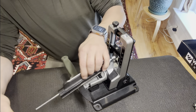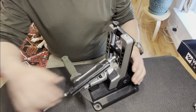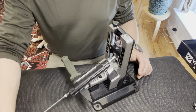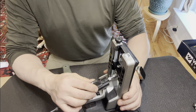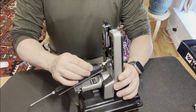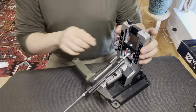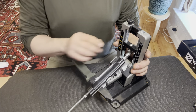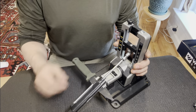Let's do it again to see if it gives a repeatable angle. It's 22 here — move it down — again 22 and a half. I wouldn't have noticed it if it didn't constitute itself in a very pronounced rocking, primarily in an up-and-down direction, which I noticed when I was sharpening. And what's even more annoying: because it's rocking, it's not lining up with the lower slide bushing, and it hits this bump, giving you a jerky motion which interrupts your stroke. I thought that was a major issue.